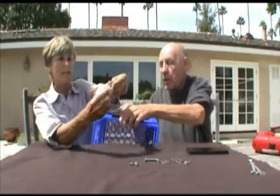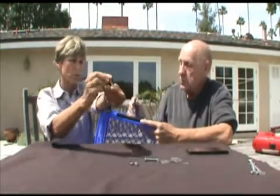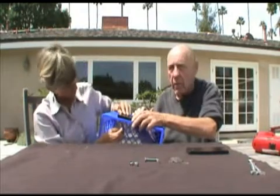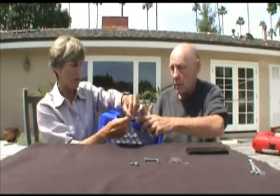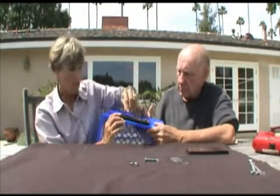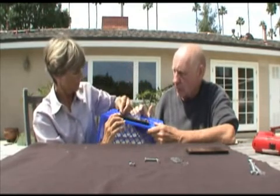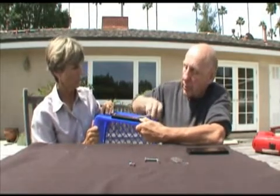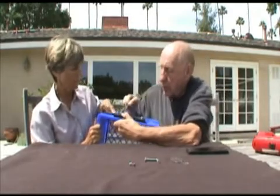Let me see if I can do it. I take my hex screw, the quarter-inch washer, put it through first, then the big fender washer — and I say that because they're kind of hard to locate, but West Marine has a great supply of stainless steel screws, bolts, and hardware, and they're very easy to locate. So I've got the three items, I thread it through, then take another quarter-inch washer and my quarter-twenty lock nut. I'm not very good at screwing with my left hand here, but we've got it started. Then we take a 7/16 open end or box wrench and tighten them up. That sounds easy enough — I think even I can do that.